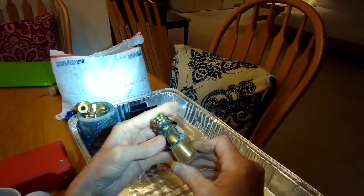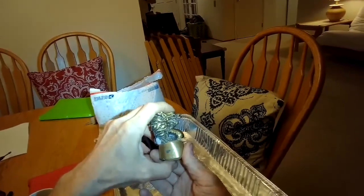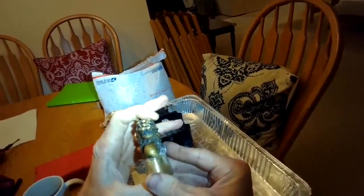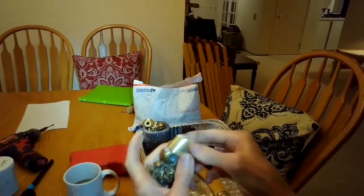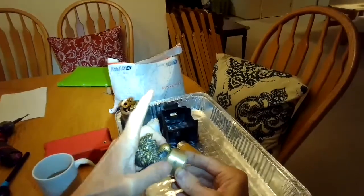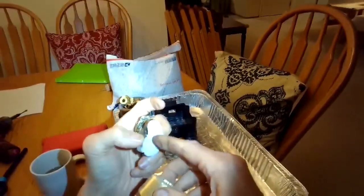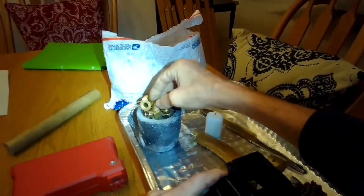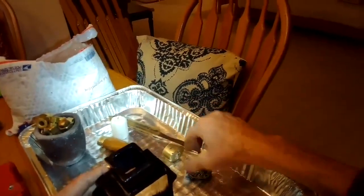I tried to attach something like that, and then where there are gaps I'm going to fill them in temporarily just with wax, and then I'll make a casting. This will be at the bottom of the sword and I think it'll be good — it'll be pretty heavy, give counterbalance, and look pretty ornate with the dragon. To do that casting, I'm going to drive a screw through here, drill a pilot hole to connect these, fill in the gaps with some wax which is full of brass scraps. Superheated, this brass will all melt down, and then I'll pour in the brass and it'll form this pretty heavy pommel shaped just like this dragon.